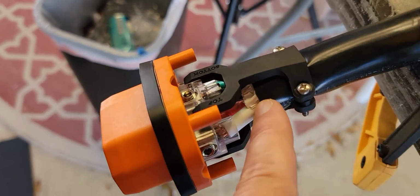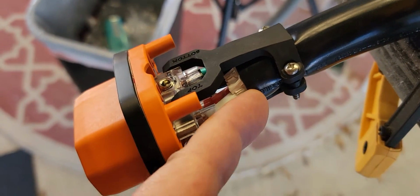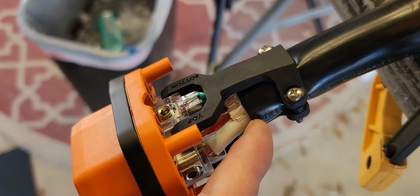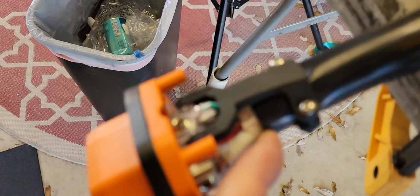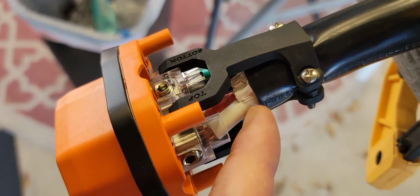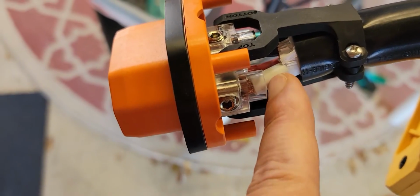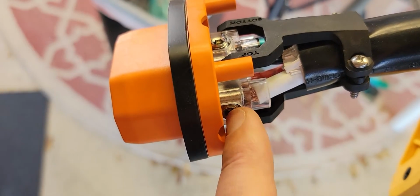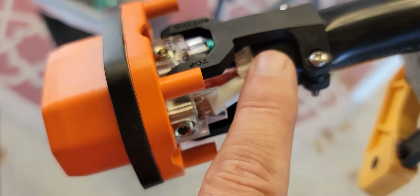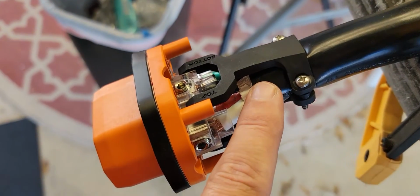But I did also want to talk about the outer rubber on this cord. The instructions say, I believe it was 1 1/4, whatever the instructions said, it was too dang long. It wasn't allowing these cords to move and push up in here, and I was not getting good purchase. So I wound up taking more of this off, and that's perfectly fine. You can totally do that.